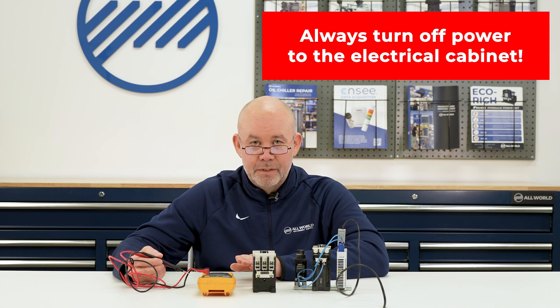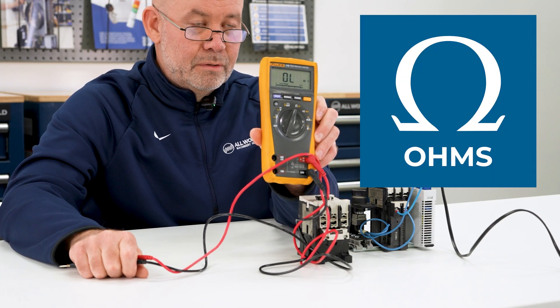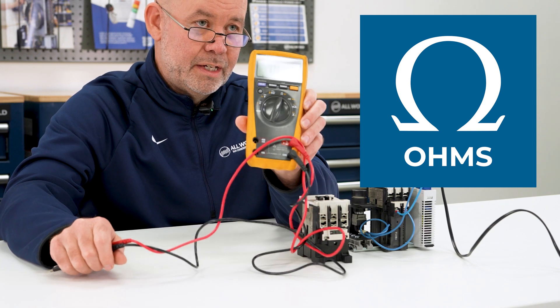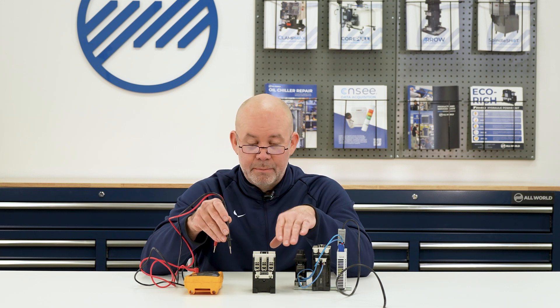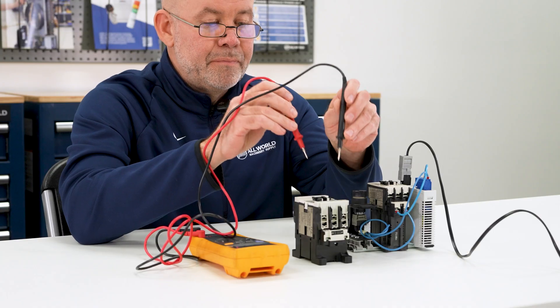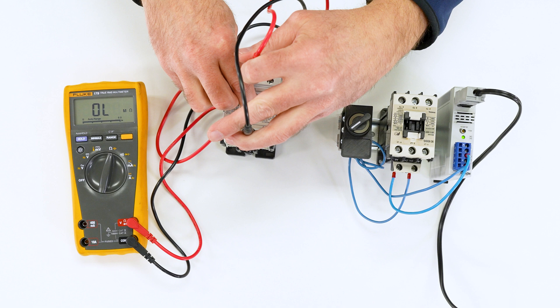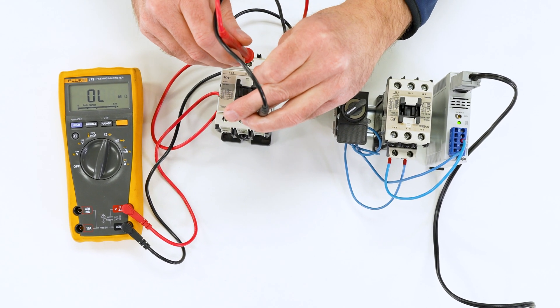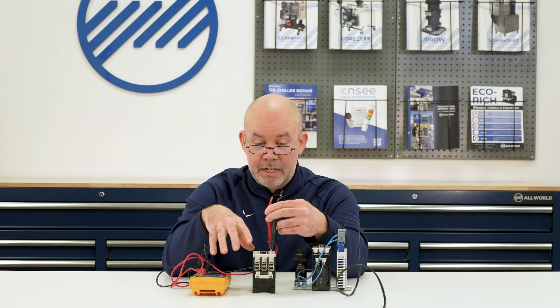At this point, power to the machine or the control cabinet is turned off because now we're going to be checking areas that have high voltage. Turn the multimeter to the ohms setting — we're going to start measuring the resistance of the contacts themselves. This can normally be done manually with most contactors. We first want to check across each leg of the contactor with the meter set to ohms. Right now we're reading open, which we should, because the contactor is not turned on. If you check across the contacts and you do get a reading, that's a sign the contactor is bad because your contacts are welded shut — with power off, they should be open.